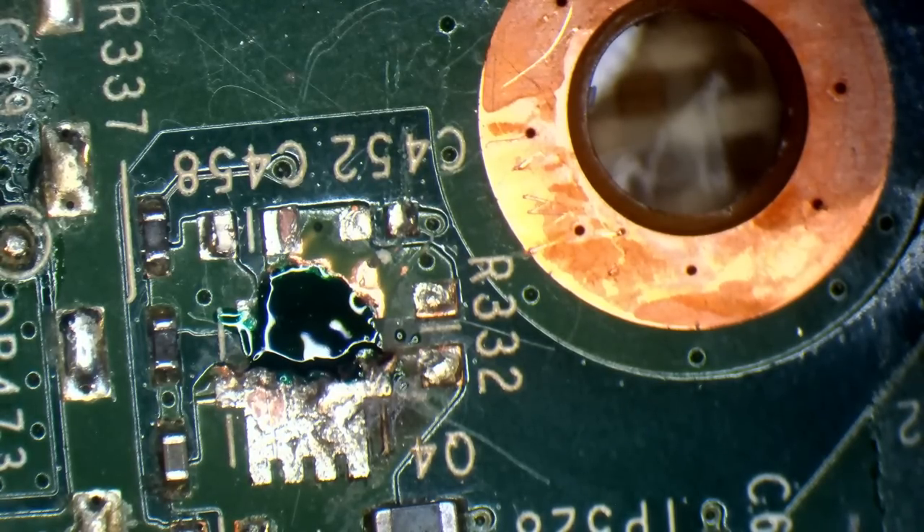That's why I ground away the carbonisation — I didn't want it to short between two layers and I didn't want it to eat through the substrate and hit another layer, which would cause a lot of resistance between the top layer and the layer underneath — a domino effect that keeps getting worse. So I dug away at it, cleaned up the substrate, made sure there's no carbonisation, and now I can re-protect and rebuild it.